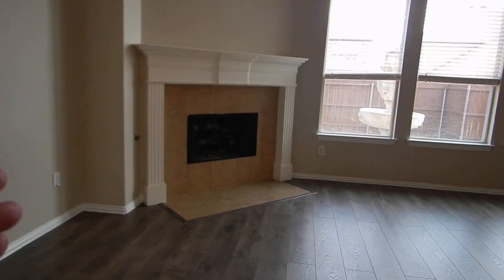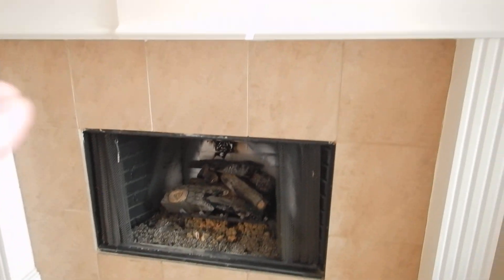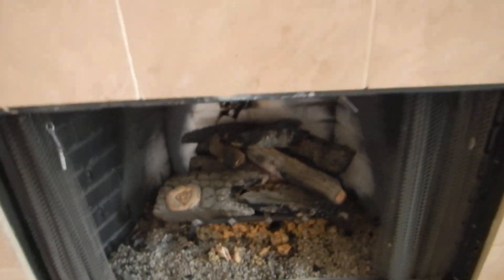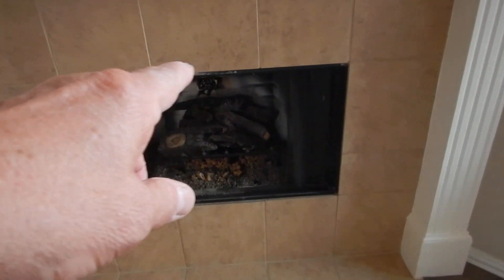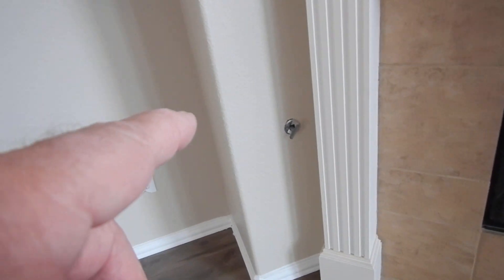Moving along into the kitchen - appliances. Look at the fireplace. The hearth extension extends far enough. It doesn't have an energy-saving glass front - it's not required. It has a screen - that's a good thing. There's a lot of soot in this fireplace. I'm just not so sure why there's so much soot in an artificial fireplace - they don't make smoke, they make soot. You cannot close the chimney damper 100% - you're not supposed to be able to because it's an artificial gas log. The gas key is present. It's missing its hood out there around the corner.